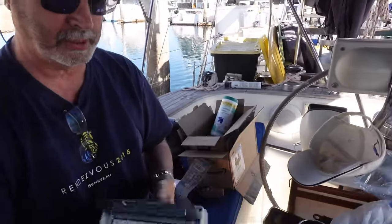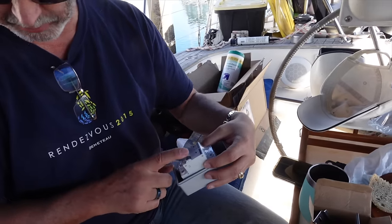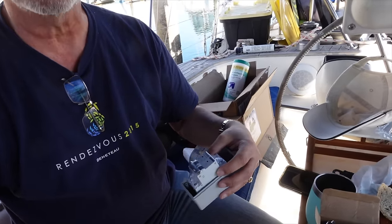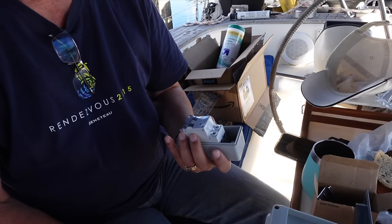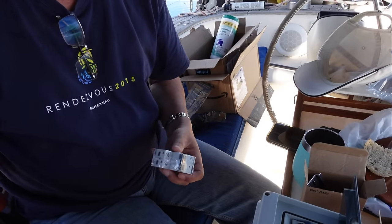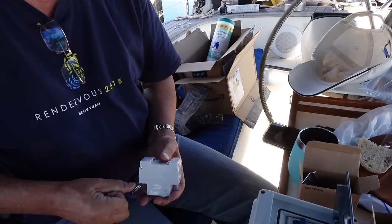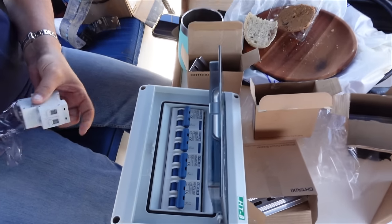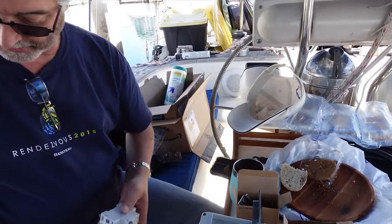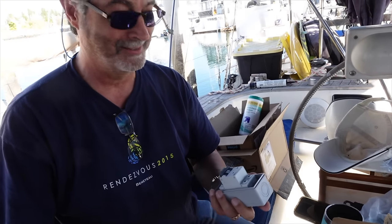That's if Lee does his job — nothing will explode and spray all over the place. Well, it's lucky it's got a cover! It's very neat. This is a 32-amp breaker, and then we have a 50-amp breaker dedicated for the shore power — nice little DIN rail mount miniature breakers. Everything will be safe; you'll be able to isolate everything when you need to fix something, so Lee doesn't have to pull any wires off. You can just isolate the circuits — easy to avoid Lee dying. That's not good for the captain, or the crew. Thanks, Brian.